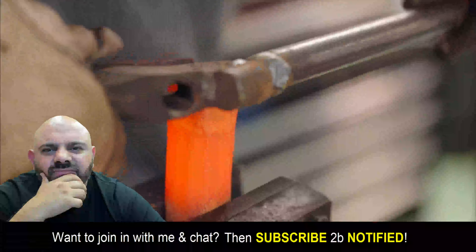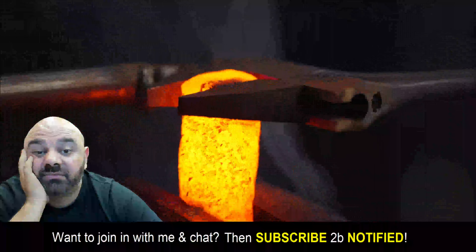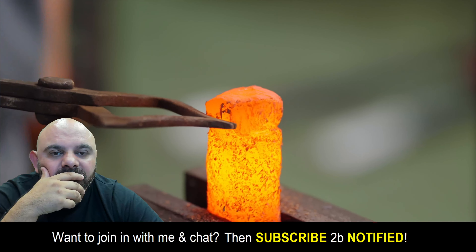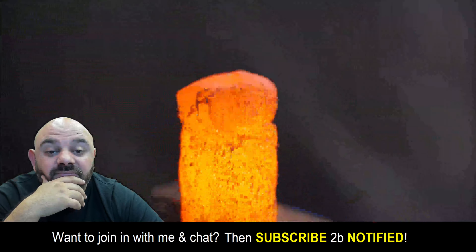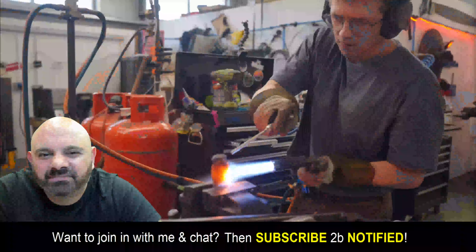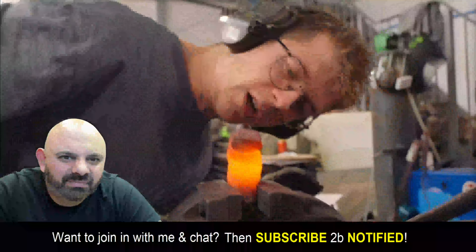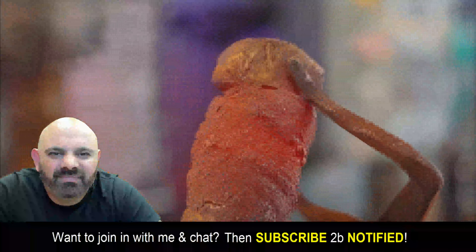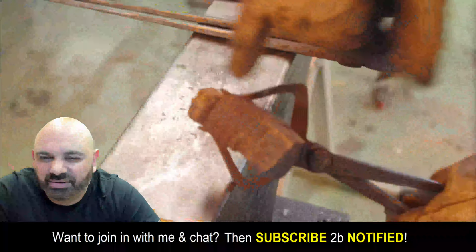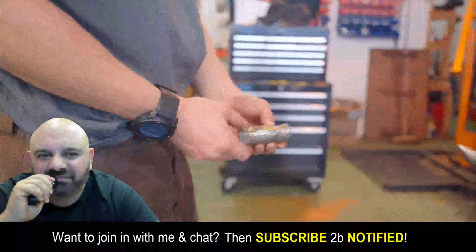We hit the diagonals to make a rough octagon and it doesn't look like it's come apart yet — it's fully trying to shear those welds apart but it so far looks like it's staying together. Twisting titanium Damascus! Steel will usually allow me to make a little reduction in size up here and still twist down there — nothing's twisting here, it's only trying to shear off. We're going to need some heat control and roll with a torch. It's going to shear off if I'm not careful — maybe I just need to cool that end more. It looks like it's screaming, wants to rip apart. It did not like that at all. I'm going to let that cool and then hit it with a grinder to smooth out all these nasty bits so that we're not pounding any potential cracks deeper into the material.